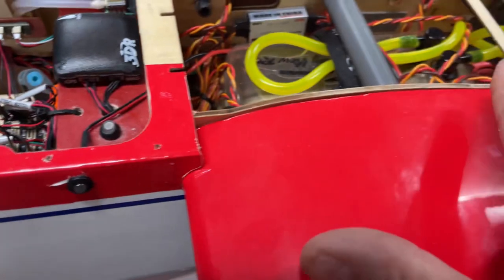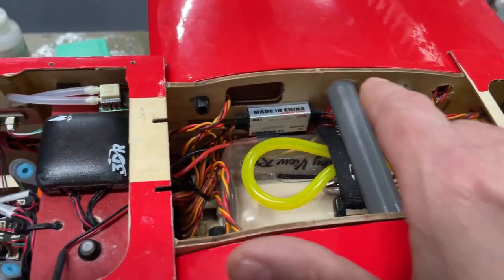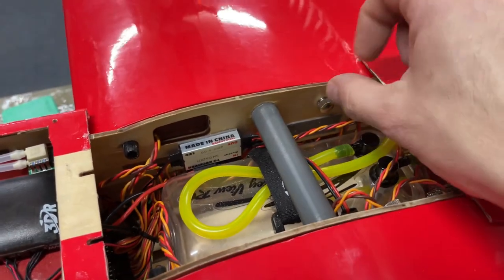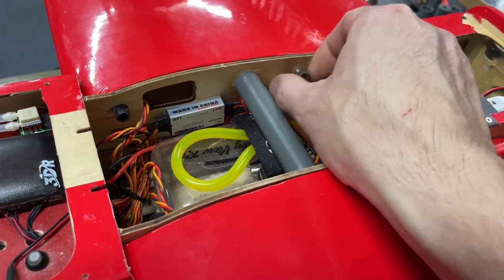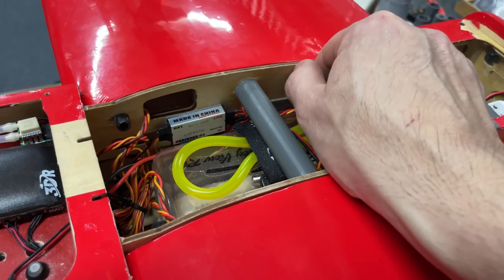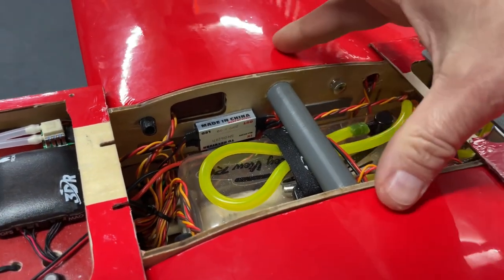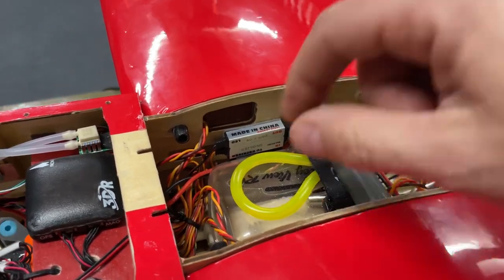The other one goes out to the ignition system. So we do have the kill switch on the ignition through the autopilot and through the RC controller through a pass-through. I did swap out the Allen heads to these knurled M3 screws. Much easier to assemble the aircraft with only one tool now, and you don't have to try to reach in there. One of the other things that I did print out here is this joining tube so that the wing tube is nicely seated between these.